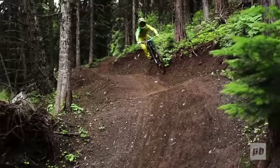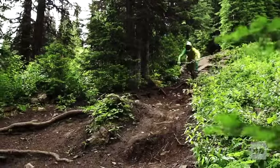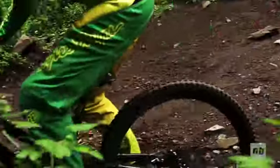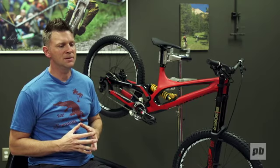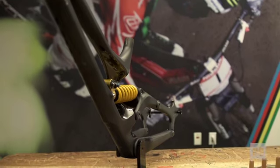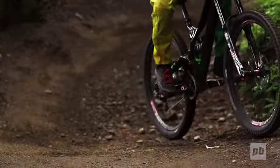Wheel path is a big topic of interest in the bike industry. And at the onset of this project, we purchased every bike out there with every imaginable wheel path, so we could really understand. And what we found is that we could achieve the same level of performance through a properly tuned FSR with an Öhlins shock as you could with some of the radical designs with crazy wheel paths.